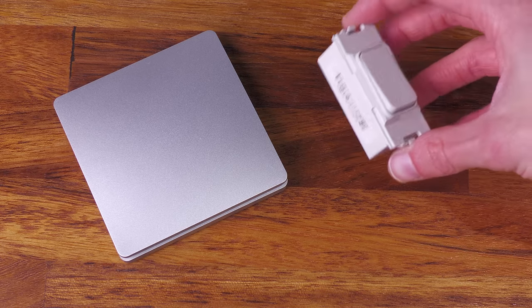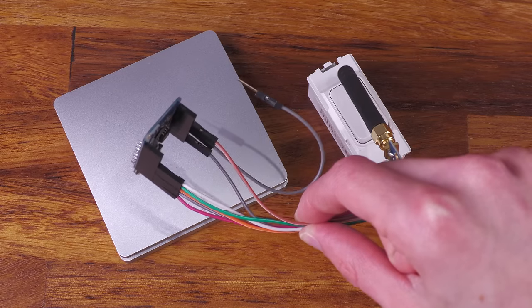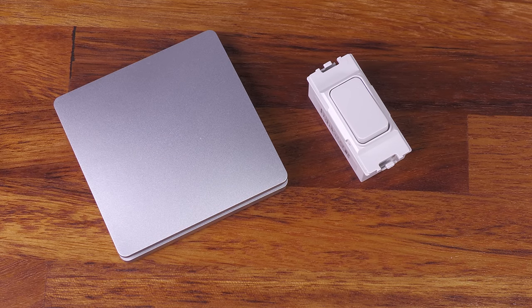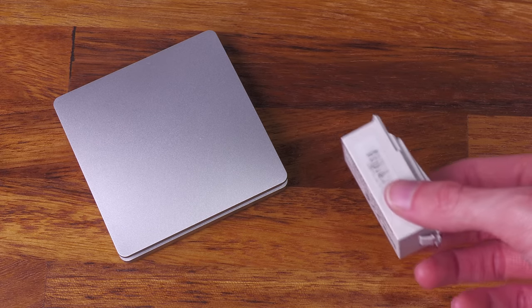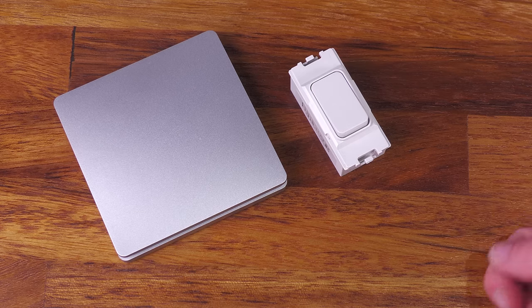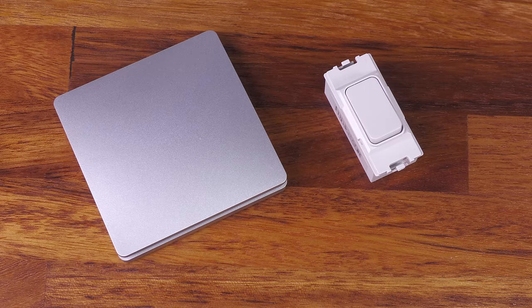These are FSK devices. If you immediately thought of buying a Sonoff or other Tasmota-flashable 433 MHz RF receiver - those will not work, because those only support ASK. People have reported trying to connect Kinetic switches to those and getting no signal. Looking at the hardware, those chips are ASK receivers not FSK receivers. ASK is much simpler and what a lot of cheap key fob remotes use. So we can't use any standard off-the-shelf Sonoff-type hubs running Tasmota - we need something more custom.